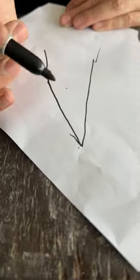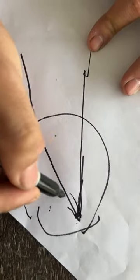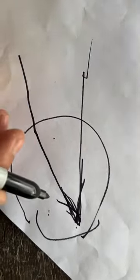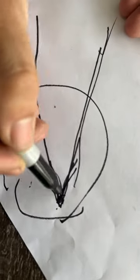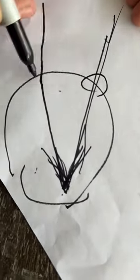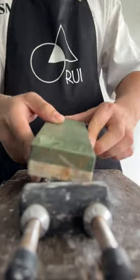This part is made very thin. What you're gonna do is create another edge — a micro bevel like this. It's still gonna be sharp and it's gonna last a lot longer, because if you sharpen the whole flat it takes too long. Just sharpen this part and make it 50/50 here — this portion — while the rest remains 20/80 for your best sharpening.